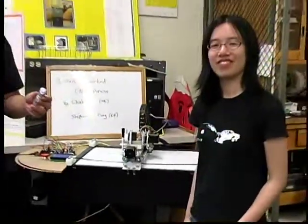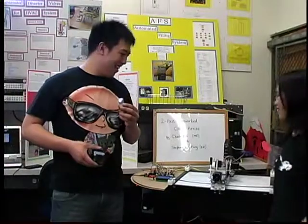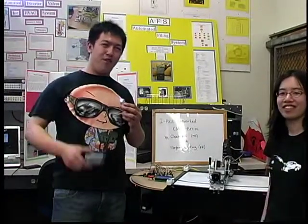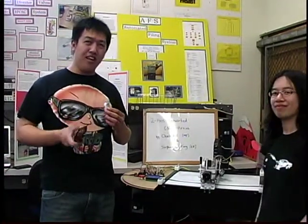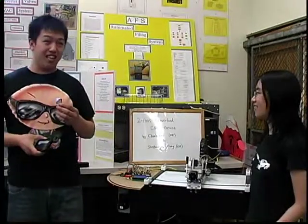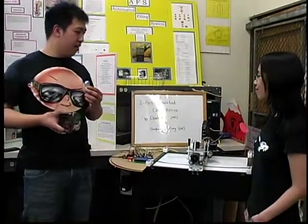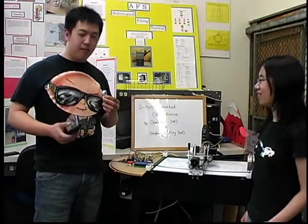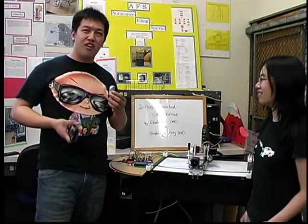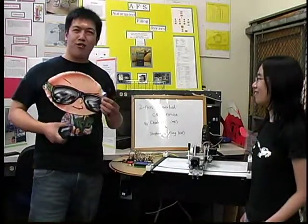So what did you guys learn in all this? We learned that the coding for the G-code is actually really complicated. We're going through the program, and it's about 3-4 pages long, and we're just trying to figure out how it interprets the simple code and turns it into an Arduino movement. And that took us at least 2-3 days. And another issue we're having was the power to the stepper motors. We weren't having enough power delivered, so sometimes our system wouldn't move as we thought it would, and we spent hours thinking the motor was stuck or something.